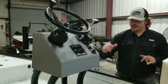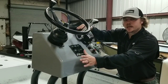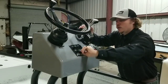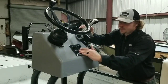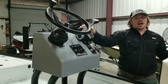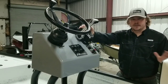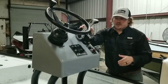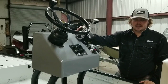Here at the helm I've got my kill switch and ignition switch. I've got the binnacle, and there's a spare switch set if you want to add a floodlight or anything else. You have a 12-volt plug-in, so you can charge your cell phone on the go. Anchor lights here, nav lights here, bilge pump here. We set up all of our boats with an automatic bilge pump — that's a no-brainer safety feature on a small boat like this. And then your aerator for the forward live well. Everything is really easy to get to and easy to see, and you have tilt at the helm.